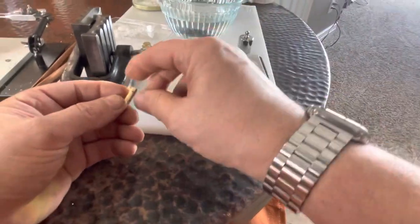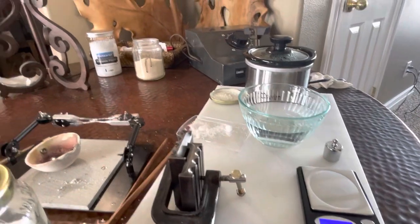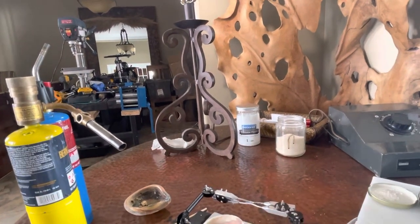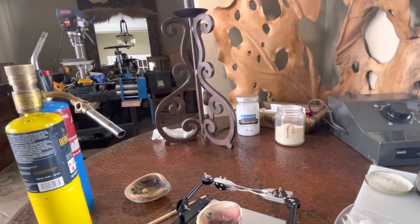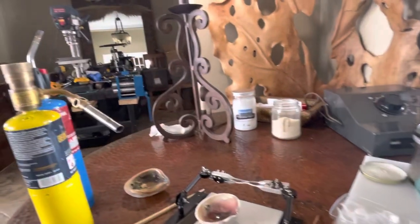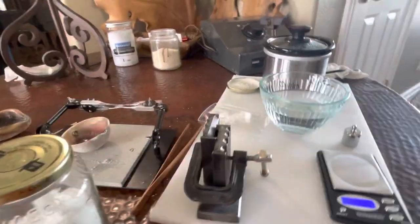All right. Yeah, the reason I want to test that rolling mill is because the two bolts that control the rollers are incredibly thin for how thick they are on most rolling mills. But then a good rolling mill is $1,000 or something, or at least over 700, not 140, and it came damaged. One of the roller adjusters was bent because it got just dropped on its head, and of course that would have never got bent with a really thick bolt. I'm talking about the bolts that push the rollers down. So the bolts on those top gear heads, one was bent. I had to straighten it, and rather than accept a return, they gave it to me for half price. So if you talk to the right eBayer.